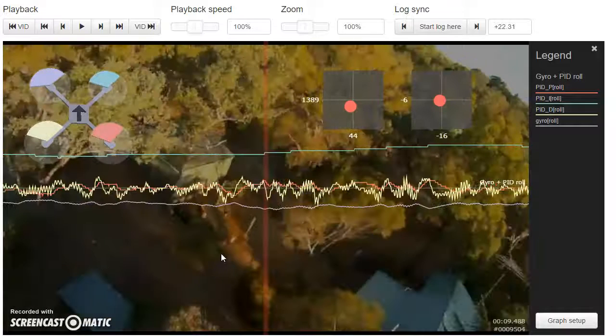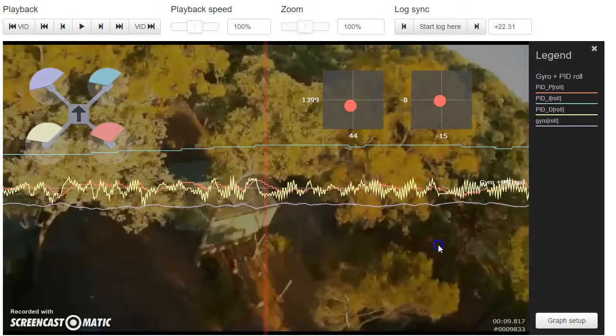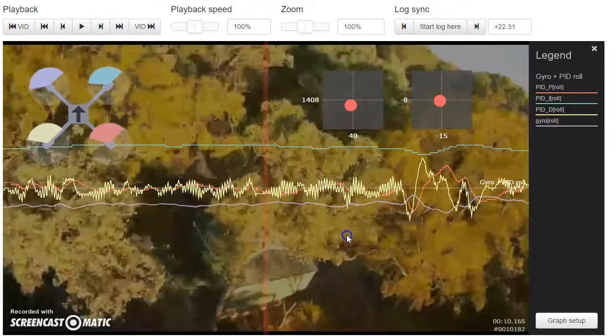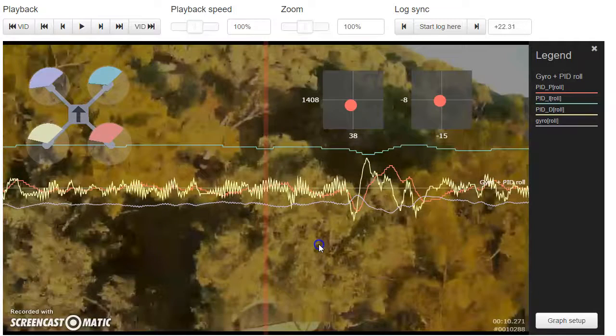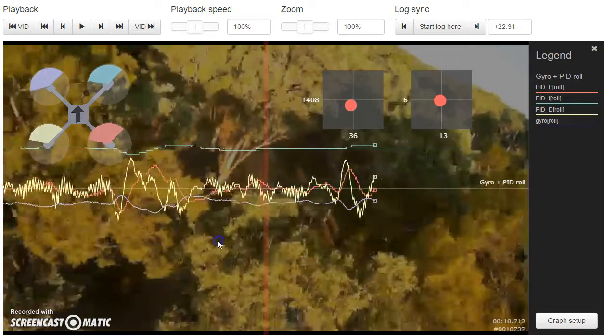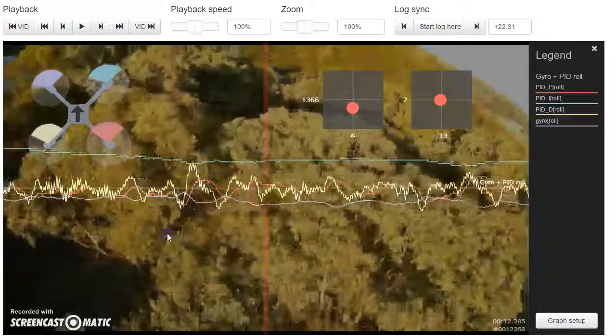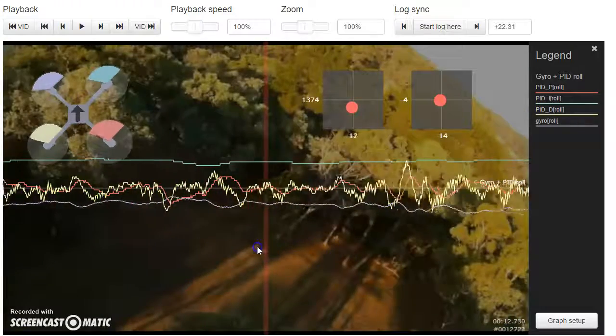All that being said, it feels to me like there's more noise in here than I would expect, especially given you're on an older Betaflight from like October. And that I think is before we really started tweaking around with gyrosync and the D term filtering getting reduced. So this does make me wonder what your D term cut hertz is and whether it should be reduced. I don't know. Maybe it should stay the same. I agree with you that your P term does not look hyperactive.